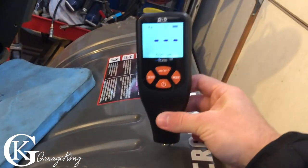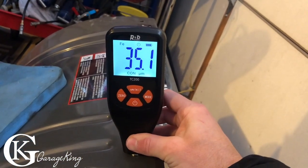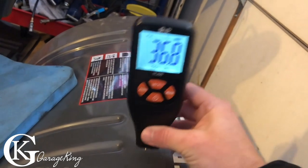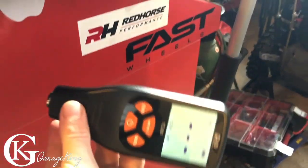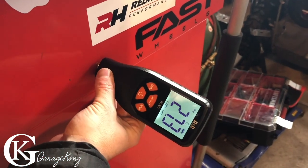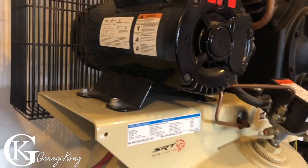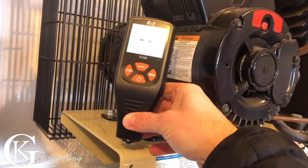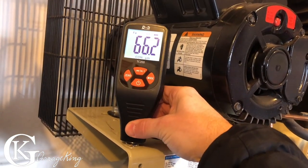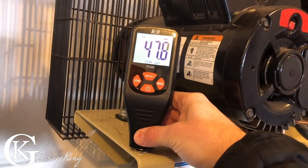Let's check the thickness of my paint on my snow blower — 35 microns. What about a shop tool? This is powder coated — about 27 microns. What about my air compressor? It's powder coated as well, I expected around the 30 range. A little bit thicker on the air compressor — close to 50 microns.